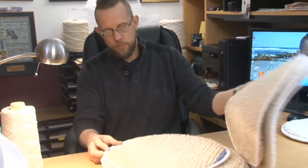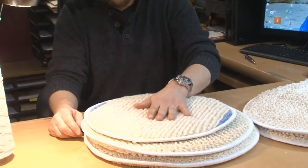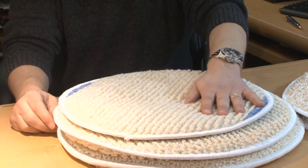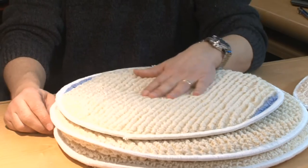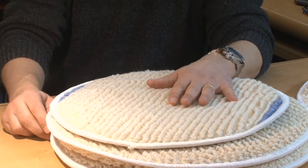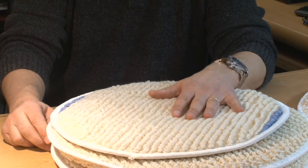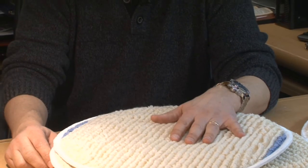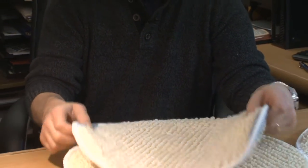Products like the wool piece. The wool dissipates heat, and they run very cool, and they're very easy to run on the machine. They run like a synthetic pad. They will not remove as much soil as the cotton will, but if you have a delicate carpet or you have a wool carpet, this limited use pad would be the right choice for that application.